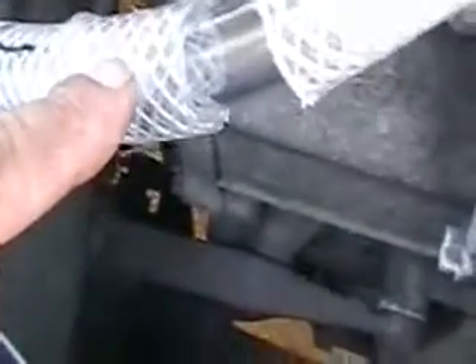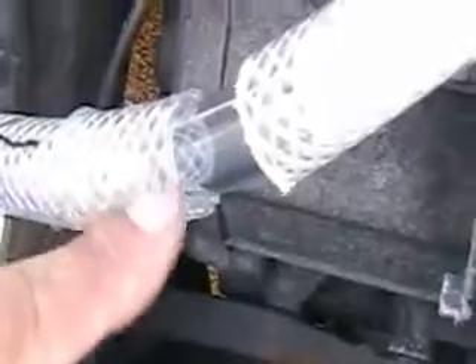We've got hydrogen and oxygen now flowing through the bubbler. There's also a one-way valve here — hopefully when I turn this off it's not going to suck the water back into the cell. The connection goes all the way down to the bottom of the bubbler via a tube, so normally when you turn the cell off you get a vacuum and the water gets drawn right back into the cell, which happened last year when I had it running. Now I've got a valve hooked up that's going to stop that.